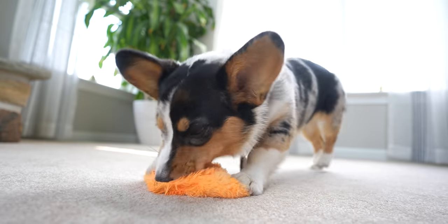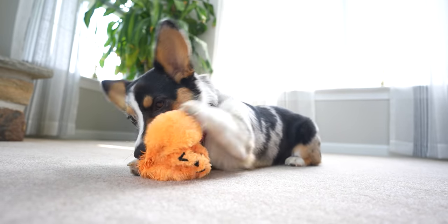One thing I did was add a little bit of polyfill inside the bottom of the plastic housing — just to help absorb some of that hollow plastic resonance and dampen it a little bit. Polyfill is very cheap; odds are if you have a dog you know their toys are filled with polyfill. You can also just use a thin layer of foam, which is actually what I'd prefer, but I'm fresh out. Anything on the bottom under the PCB to absorb sound is gonna be great with that plastic case.